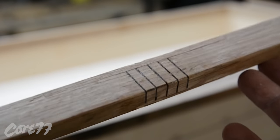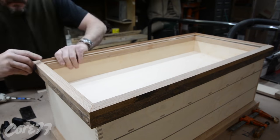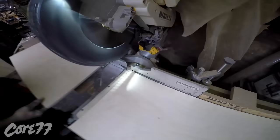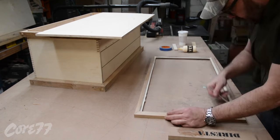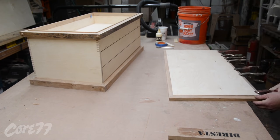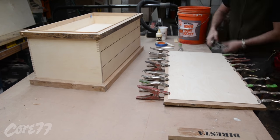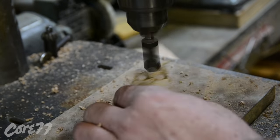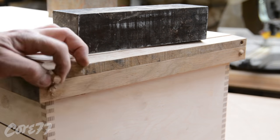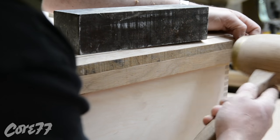This piece of wood was bent, so I put a bunch of relief cuts in it and just put a big piece of veneer over it so you couldn't see the relief cuts — you'll be able to see them inside the toolbox lid. This is my lid. I had to go into a second sheet of plywood. You can never have too many squeeze clamps. That lid sits perfectly on top of the bottom one because I put that little bezel to hold it in place.